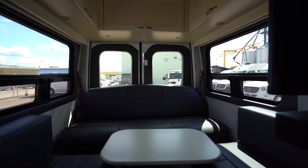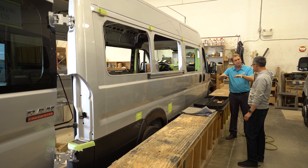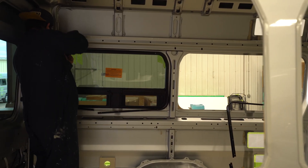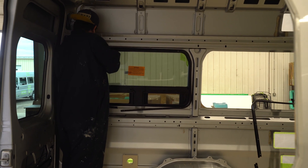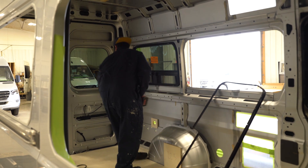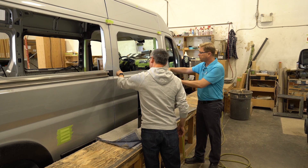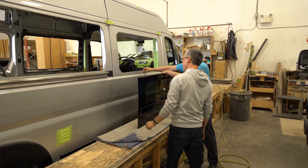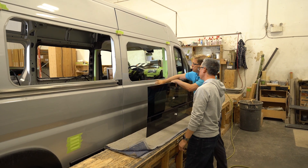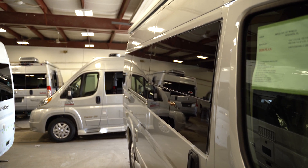And these are glass — not plastic. It's glass and they also have the jalousie, so they're going to open up and vent at the bottom, so you can keep them open if it's raining. It'll get sealed, and when we attach it there's a trim ring you can see inside that sucks it up to the side of the van — that's how it mounts. So you cut these openings, and this is like a putty tape where the glass is going to go up and seal against. Then on the inside, it's going to get sucked together with a trim ring.